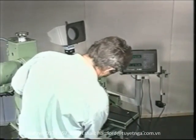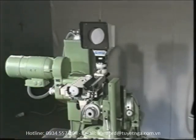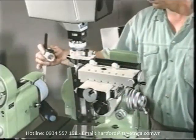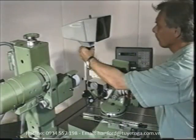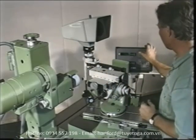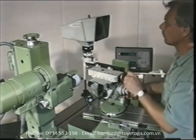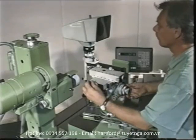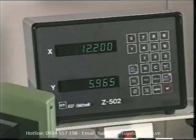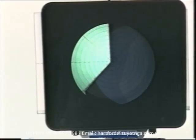The optoelectronic measuring unit can be used to check dimensions along and square to the cutting tool. The unit can remain on the index head or the support bracket of the radius grinding device during the grinding process, thus enabling the operator to keep the grinding zone constantly under observation through a projector or microscope. Precision linear measuring systems measure the lengths of slide travel, and the electronic system provides a digital display of the exact dimensions.